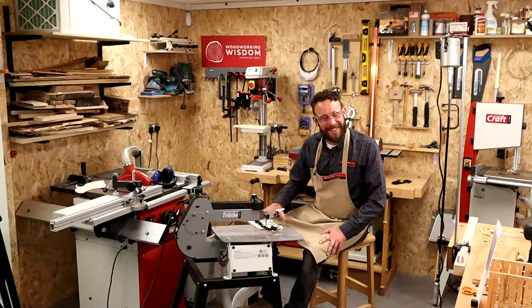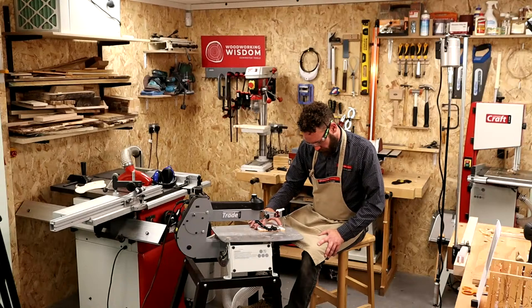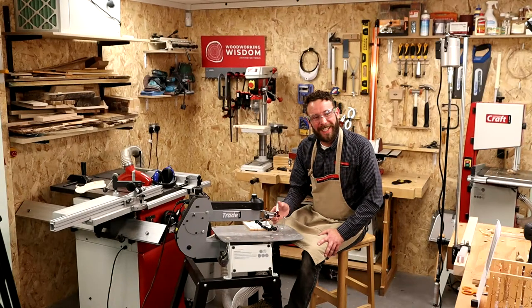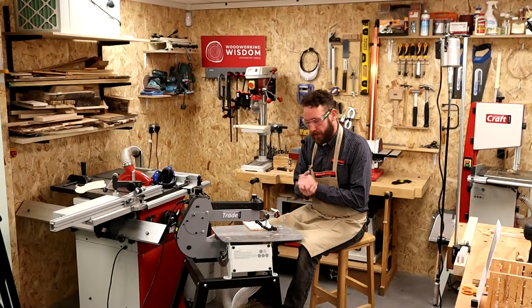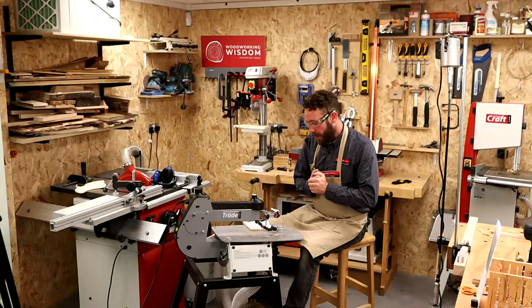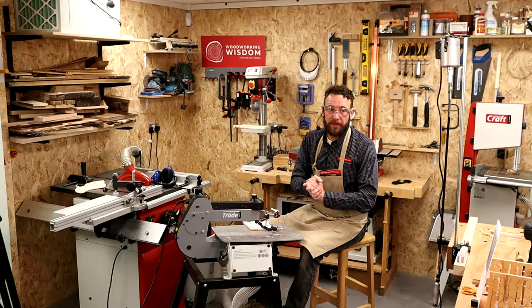Okay. Yeah, Ben, a question from Bill. Will the skip tooth blades do as good a job? Can't get on with the spiral blades. They seem to have a mind of their own. Okay. So, like I say, it will cut in all different directions. And there's no rest in the blade on those ones. The skip tooth, that's only going to give you bigger spacings between the teeth.